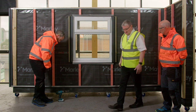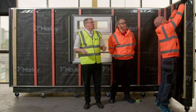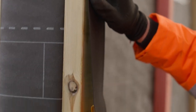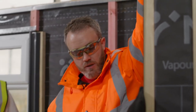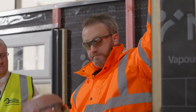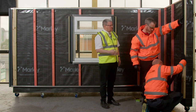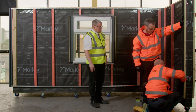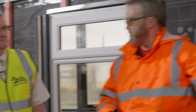We're now putting EPDM tape on this end. As you can see, it's got a release film on the back so it sticks without any glues — nice and easy, nice and clean. Anywhere where you've got a vertical profile, a corner, an abutment, or a butt joint with two adjoining planks, you put a strip of EPDM. At JJ's you can get 50mm, 75mm, and 100mm. No primers needed.